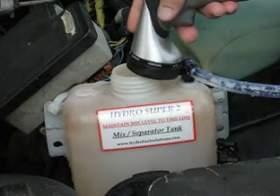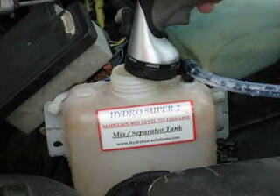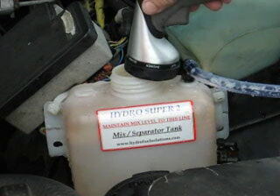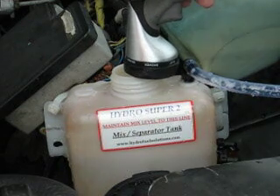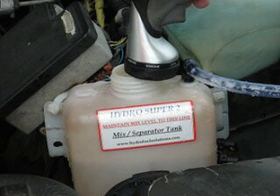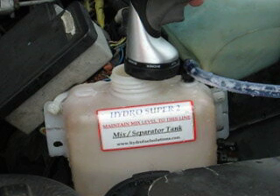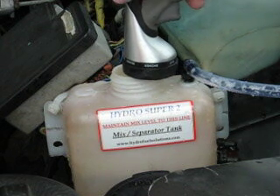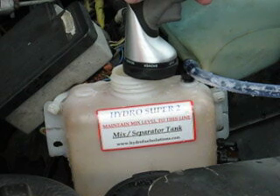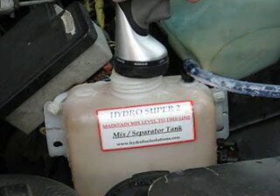I'm not really sure where I went wrong, but my production is way off. That one I was running 22 amps. The mixture was at 130 degrees, but my production — I've got a half liter bottle — and the half liter bottle took just over 35 to 40 seconds to fill a half liter doing the water displacement test. I think it's actually like 657 milliliters, but it still took 40 seconds to fill.